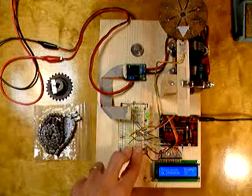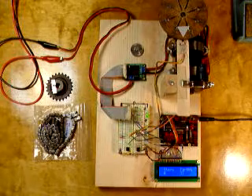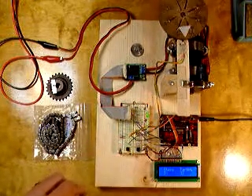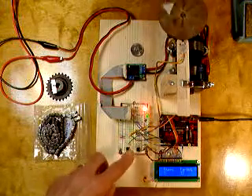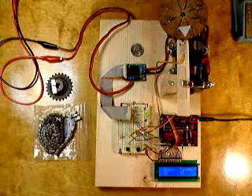Now I press the buttons twice again — I'm going to go immediately to slew mode. In slew mode, when I press the button, the wheel will take that number of steps, which equates to a quarter-inch movement of the carriage. It should give me precise positioning of the box joints.